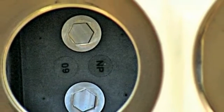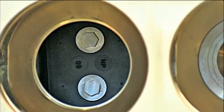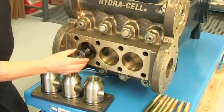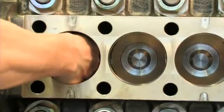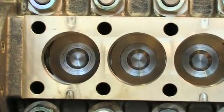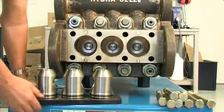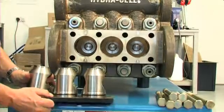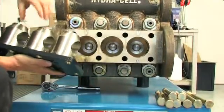At this stage the diaphragms can be visually inspected through the inlet ports with the use of a light. The reassembly is equally simple. Start by reinstalling the three inlet check valve cartridges by hand, ensuring that they seat properly. Lubricate all O-rings and backup rings and ensure the valve bore and retainer bore are clean and free of foreign material.